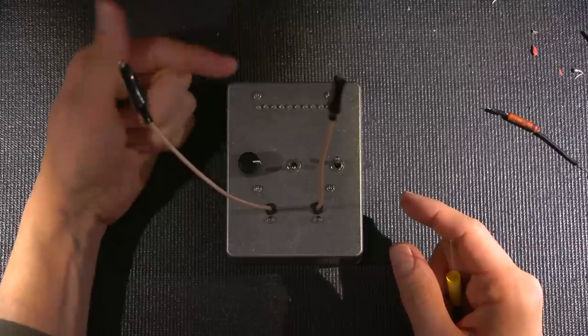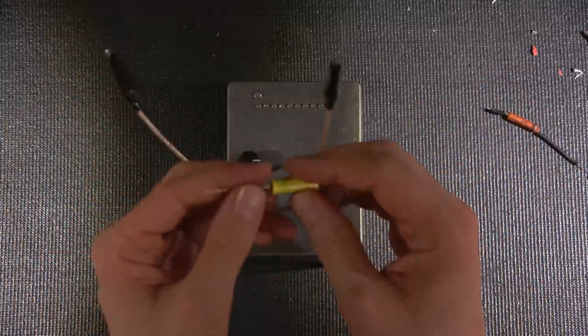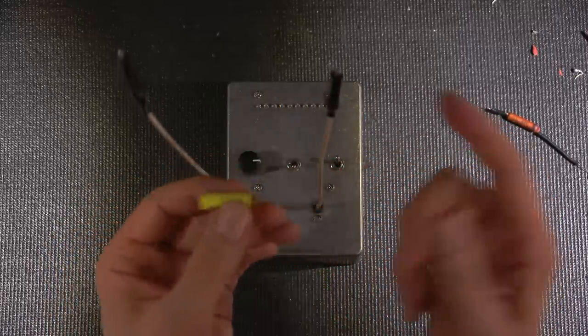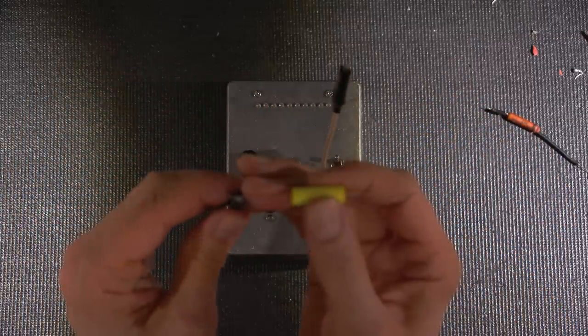It's kind of like holding an open guitar jack. When you touch the guitar, it's the same kind of thing, except this is sensing that through the shell of the capacitor. And not only that, there's even a capacitor shorting that hum out across this all the time. So you can imagine how incredibly sensitive the amplifier inside this is to indicate that.